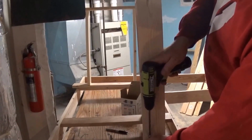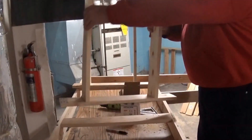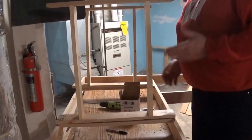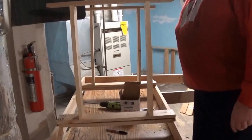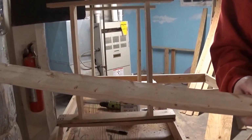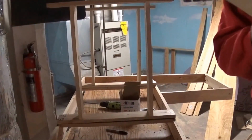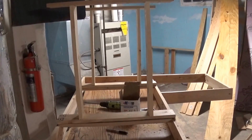And that works out like that. And then, like I said, I take these top units and line them up. Sometimes I'll clamp them if a table's a little off, because I use a cheaper wood, it can get off a little bit. But this one seems to be pretty good. Once I'm done with that, I have this, which is called a 1x3, but it's a furring strip. Or it's 1x2 actually, I believe. And I put that between the two legs to strengthen it.